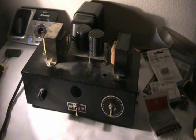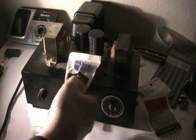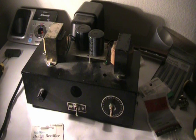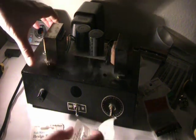Now these parts are ancient. What you have here are two 1000 microfarad capacitors. This one is a 2200, and nowadays this single one is bigger than both of those put together. This is a 25 volt transformer — way bigger than you need. So you just get a 17 volt, 2 amp transformer. And this thing right here is what you call a bridge rectifier.